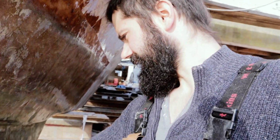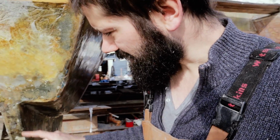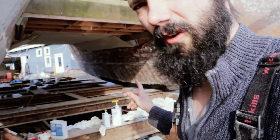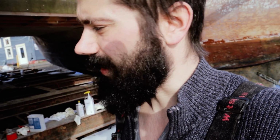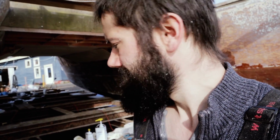Alright, well, I gotta say, so far it's okay. I've switched over to West Systems because I've run out of the Old Timers epoxy. I don't like West Systems mainly because it's thinner and it's a bit harder to work with, especially when you're leaning glass up onto a vertical surface or even an inverted surface like I'm doing right now.